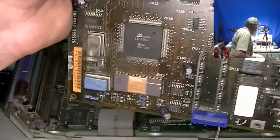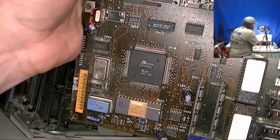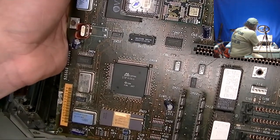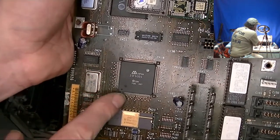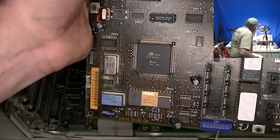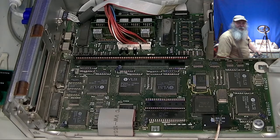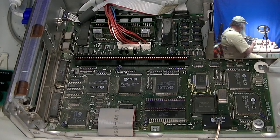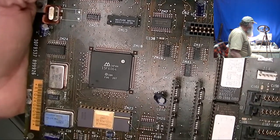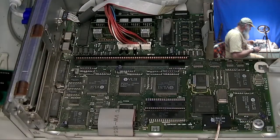I do have the VGA chip that's there, and this is the standard 15F 6864 VGA chip that IBM put on some of the planers. It looks like there's even a little bit of corrosion on the corner of those pins. If this planer is a loss, it might even be worthwhile to pull that chip and delid it. I have a supply for that chip that we can delid, and it has the Seiko Epson logo on it — it'd be interesting to see what is under the cover of that chip since it's also marked with IBM.